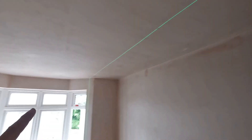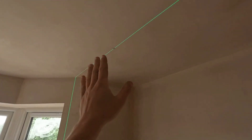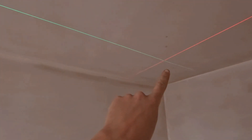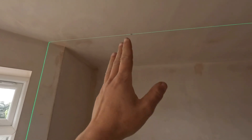I've just marked out the final three lights using the same process as the centre light. We already had the 600mm marks, I marked 920mm across from the centre light to get the mark there, ran the laser across meeting up with the two marks, then worked from that — 1600mm for the middle light, 1600mm again for the measurement of this light. So we are all measured up.